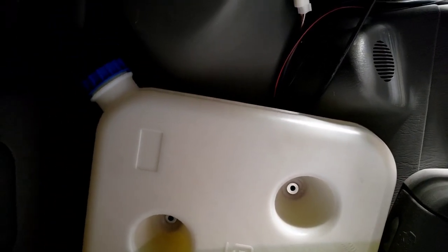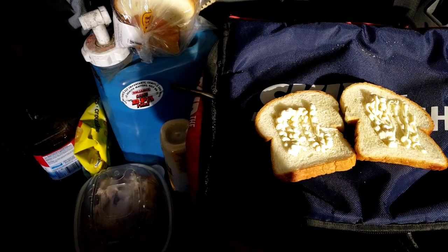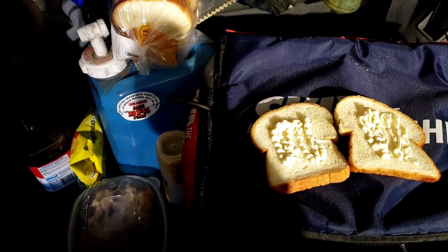I thought the inverter cutoff would be 11 volts, but I guess if you're not draining too much it goes past 11. Actually my battery dead is 9 volts, but it'll cut out before it gets there. Fully charged is 12.6, so 12.6 all the way down to 9 is the full range. You can hear that fuel pump just ticking away. Unfortunately no hikes today because it's icy everywhere. For breakfast I'm hanging my head in shame — chicken and mayonnaise sandwiches again.